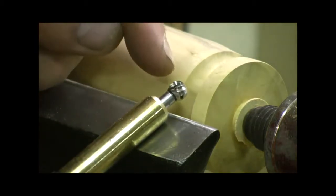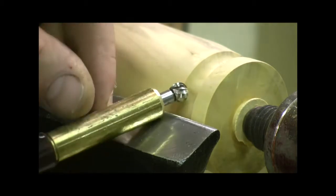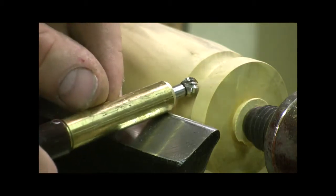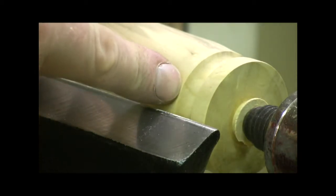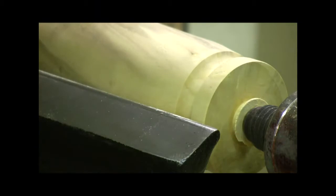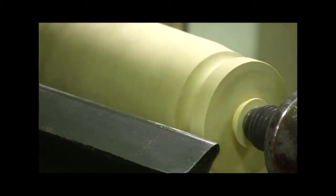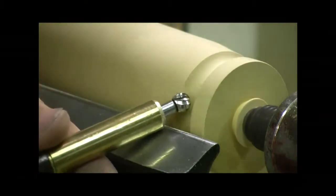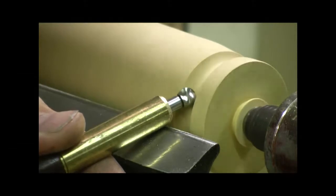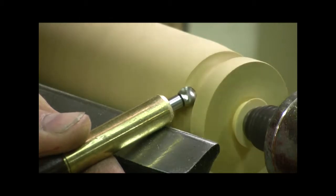And remember, we're cutting with the top left hand part of the sphere and pressing hard into the edge of the wood, leaving space for the pattern not to be breaking out on the top of the cut. We need to lower the tool rest and again reduce the speed of the lathe to about 800 RPM. Let's give it a go. Hold it in there for a little longer than you think necessary, pressing hard.